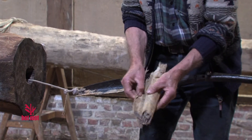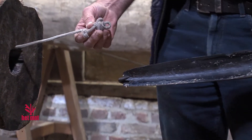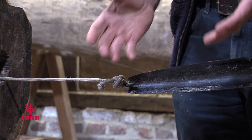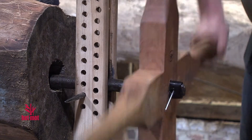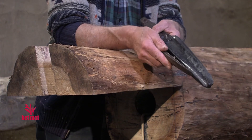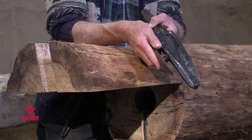It is layer by layer that it is cut away (laag per laag weggesneden). We also see the function of the hook, which has a double function — used to remove the wood shavings from inside the bore. After clearing the shavings, we can also do two borings to spread it further with a shell bore. In different steps with different shell bores and a shell, the opening can be progressively widened.